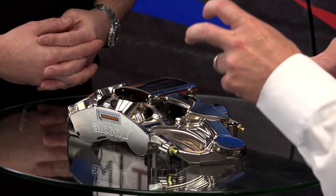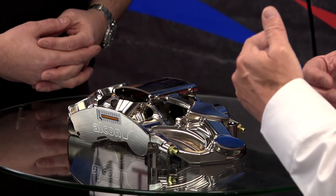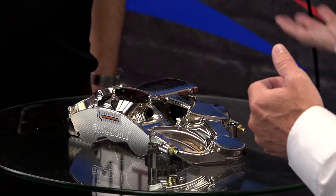Predominantly one of the reasons why the programming time was reduced so heavily using HyperMil was the ability to mirror a project over from left to right hand, and as well as mirror, respect the cutting parameters — so for example if it's climb cutting on the left hand side, when you mirror it over you want to respect that condition on the right hand side. So basically the mirror function is something HyperMil offers that the other CAM system wasn't providing. So that would immediately halve your programming time.